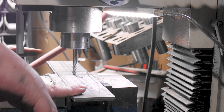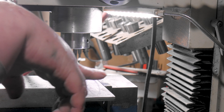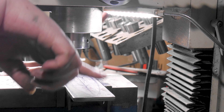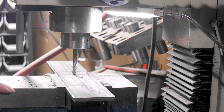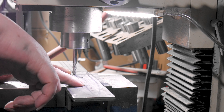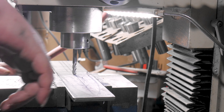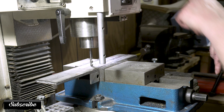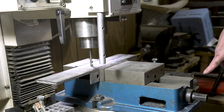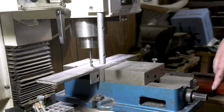So I'm gonna start this dagger. I kind of drew out a rough sketch and I don't really know what I'm gonna do with it yet, but I know I want to do a fuller in the middle. So I drew lines where I want the fuller to start, where the fuller ends, and the middle on both sides. I zeroed this out where we're at. I'm gonna go down 20 thou and then come across and see where we're at. Wish me luck.